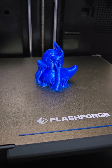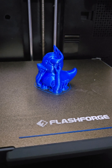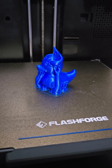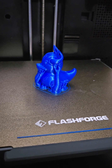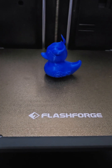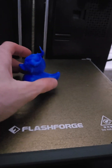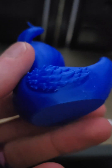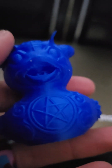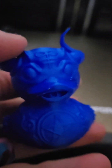This test is finally done. It only took about 5 and a half hours. This was done at 0.1mm layer height, at 20mm per second. Just got to remove the supports. Here it is without all the supports on it, and I think it actually came out pretty well. The details came out pretty well, even these little small feathers. The symbol on his chest came out pretty decent.